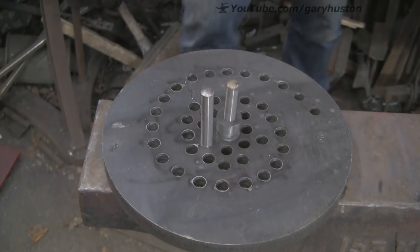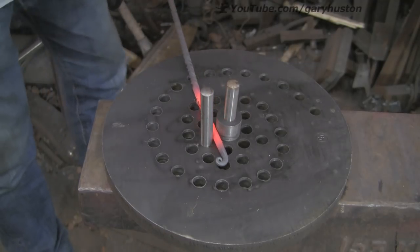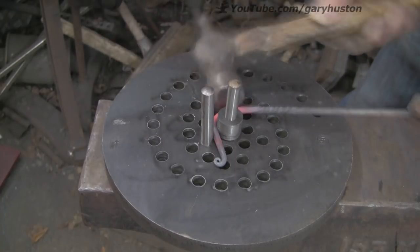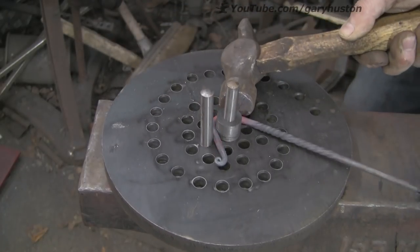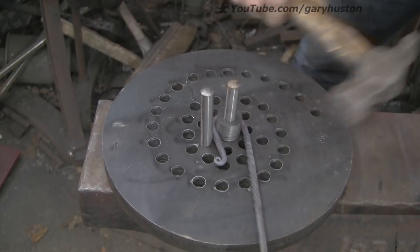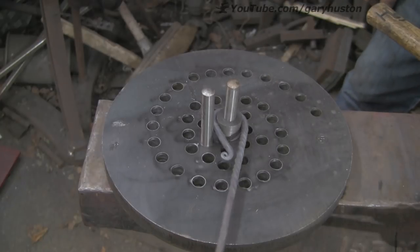You can see I'm even managing to twist it when it looks cold, but it is actually still very hot at this black heat. Now I'm going to use my jig that I made. I'm just going to pull this round and it will need a bit of hammering because the stainless is that much tougher than mild steel — if that was mild steel at quarter inch, it would just pull round with no bother. I'm just encouraging it round with a hammer.